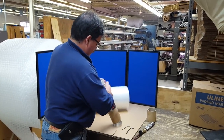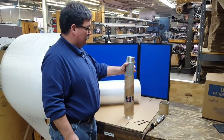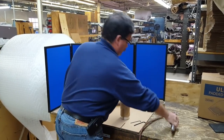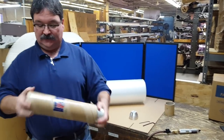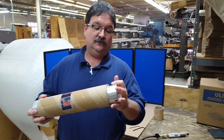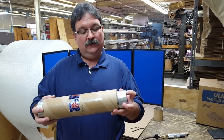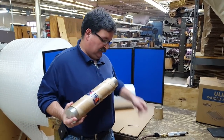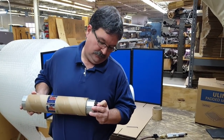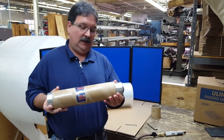In this situation, the core would be positioned like this, and you can slide the chuck inside — slide the core on — and when you inflate it, the air chuck is locked inside of that core. It'll be supported by an end plug on one side and the air chuck on the other side, which supplies all the torque. When you want to slide your core off — when your roll is empty on your unwind or full on your rewind — you simply deflate the chuck and the core will slide right over the top and come right out.